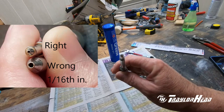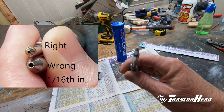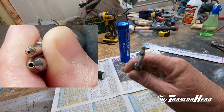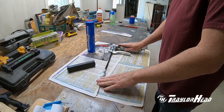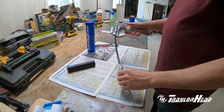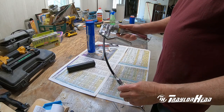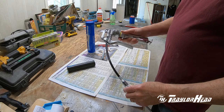I'm going to try to zoom in a little bit so you can see the tip on it. This one is small enough to depress the ball bearings on the fittings and then let the grease go in. The grease gun is the mini grease gun from Harbor Freight — that's the one listed in the manual that Next Wave Automation has for greasing the HD5.